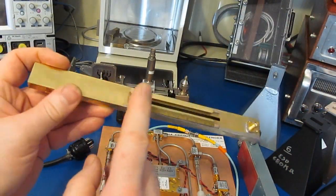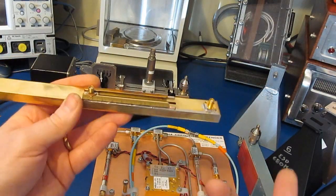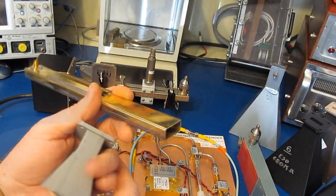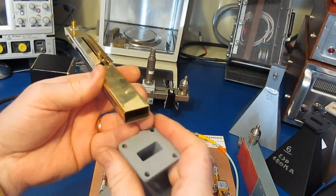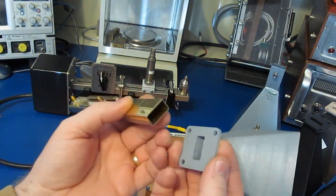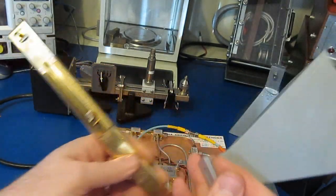Again, this is our homemade slotted waveguide, and I showed how I could use this to measure frequency, but again, I also talked about how this can be used to measure VSWR. Unfortunately, our homemade waveguide dimensionally isn't accurate. The other problem, you'll notice we don't have a flange. So to measure VSWR, we'd somehow have to couple this horn up to this waveguide.